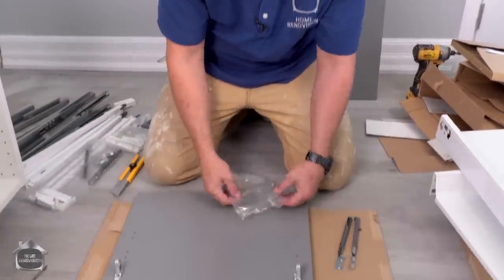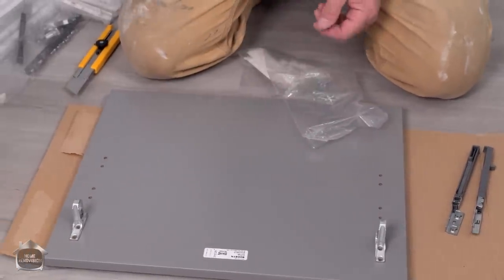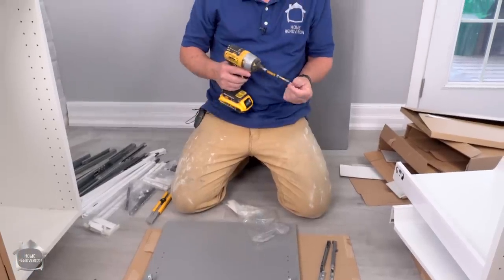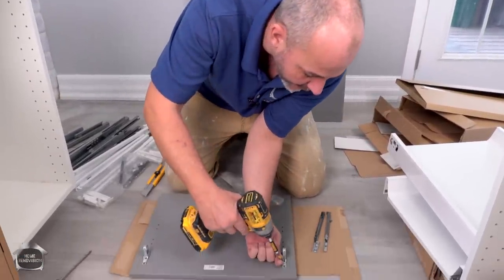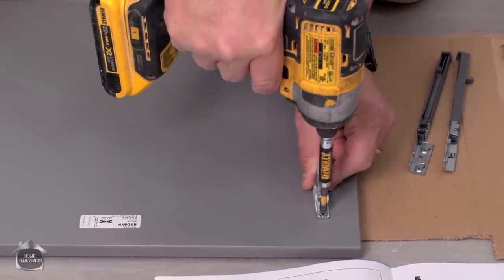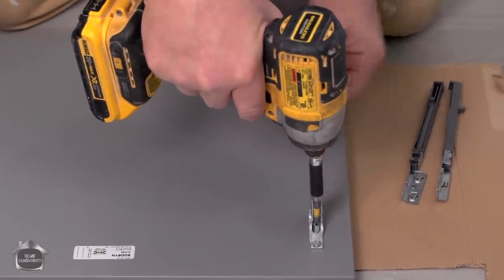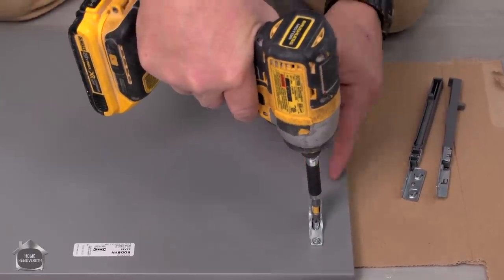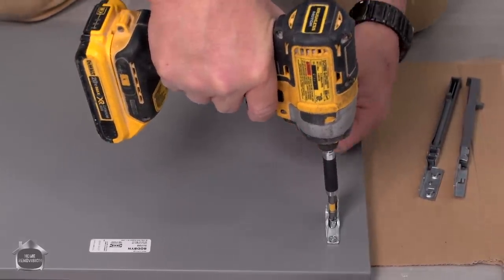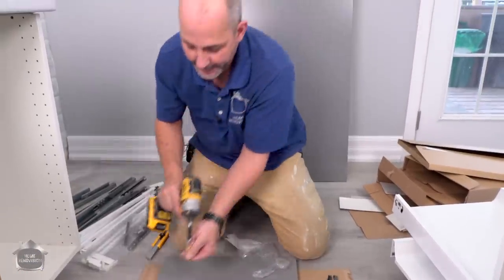Here we go. Now I'm gonna screw that together, and I'm gonna finish assembling that drawer all together. I'm gonna put the racks and the rails in, I'm gonna do the whole drawer once, so I don't confuse this and start running into problems. Now, they do suggest in the picture to use a screwdriver to put all this in, because you don't want to over tighten. If you over tighten, you'll end up stripping the material that this is made of. Remember, this is a high density fiber board. And if you screw and you drive and you drive and you drive, you're just going to end up shredding the interior of that material and it's not going to hold the hardware. Okay, feel snugging up. Feel free to stop.